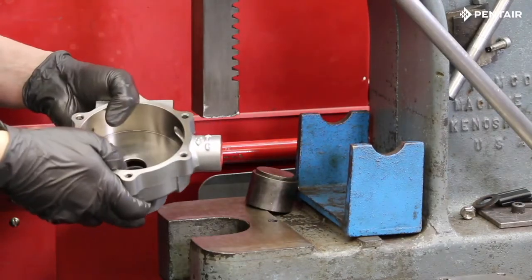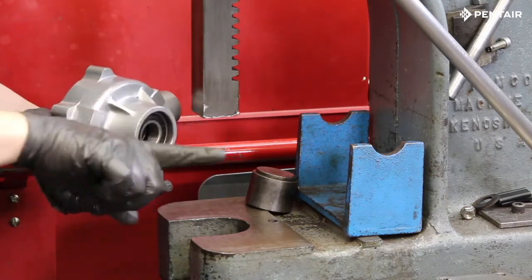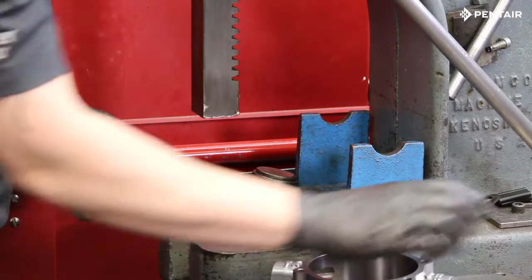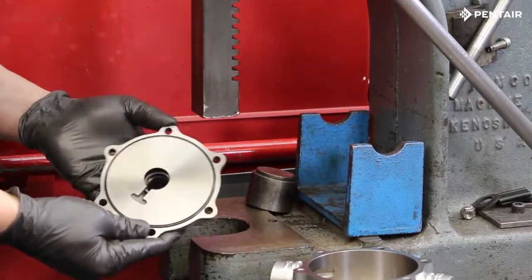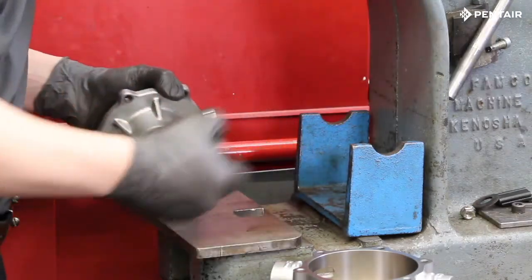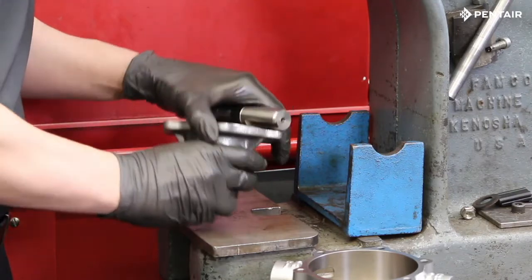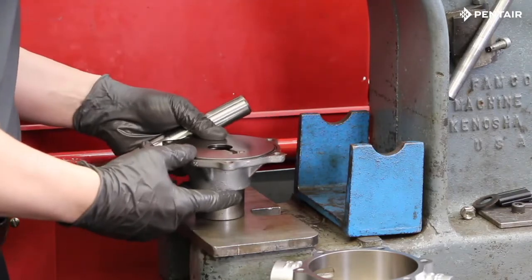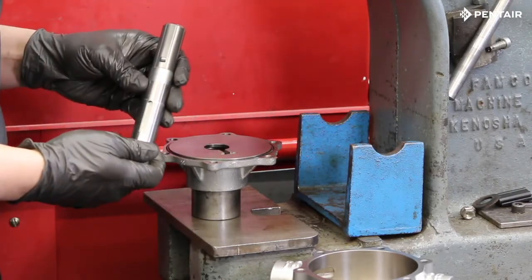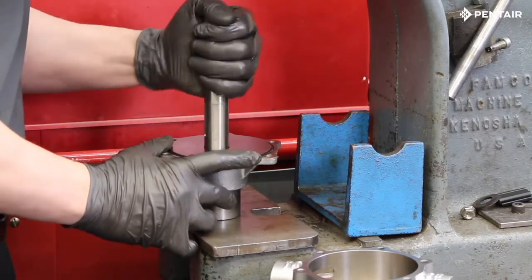Because this is a standard rotation pump, we will finish reassembly with the motor shaft facing out of the main body. Start by pressing the shaft into the end plate. Make sure you have a fixture underneath the bearing so you don't press it out while installing the shaft. Insert the shaft through the shaft seal and then press it into place.